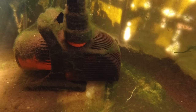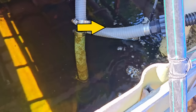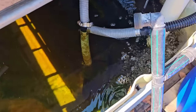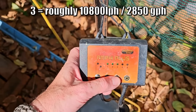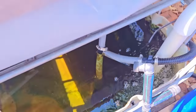It's also a great idea to oversize the pump. This one is almost 18,000 litres an hour and is set up as a split flow — a T branch goes off to the fish tank and the other hose work goes off to some grow beds. At 18,000 litres an hour it's definite overkill, but it has a control box to restrict flow by limiting power to the pump — basically a variable speed pump. The beauty of oversizing means if you decide to expand and add more grow beds in the future, there is more than enough pump capacity to increase flow.